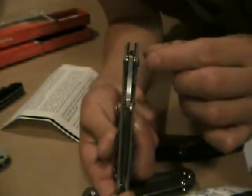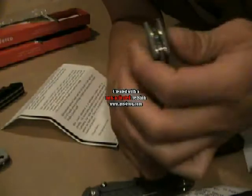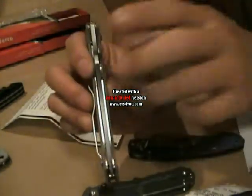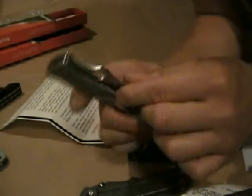The reason why I switched mine over is, since it pulls this way, all these screws on this side are going to pull naturally that way. And so what I did is I switched this male and female around so that when I tighten mine, it'll pull that direction. And mine's not centered right now because I have to take it apart. As you tighten these two screws, it really affects this one, the centering. So that's what I'm saying.